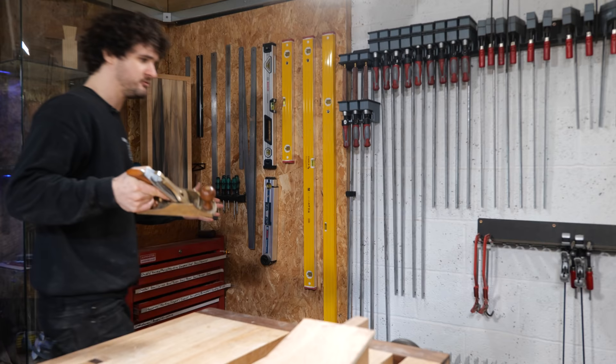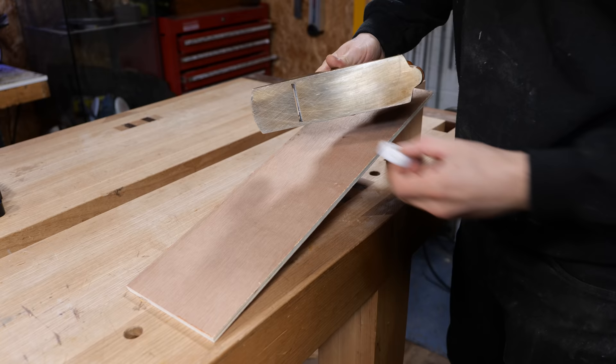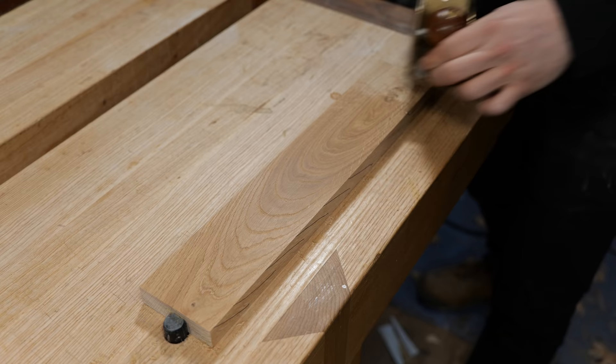Now that subject was quite in depth, so here's a very quick tip. Here's a ramp of plywood and here's a plane — put the plane on there and it kind of gets stuck. However, if you scribble a little bit of candle wax on the bottom of the plane, just a few squiggles, and then put it back on the ramp — there we go. If you've got a lot of planing to do and you're finding it quite tiresome on your arms, putting a bit of candle wax or paraffin wax on the sole of the plane can do wonders.